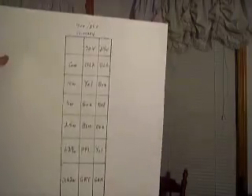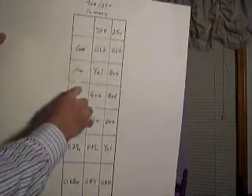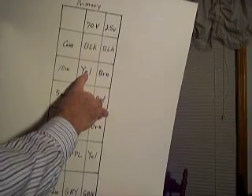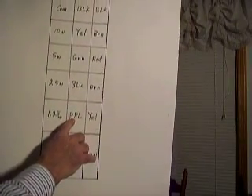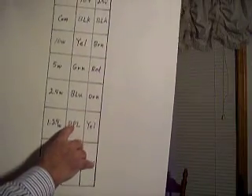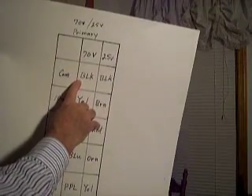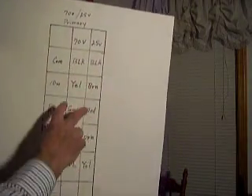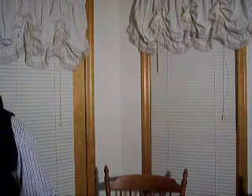Let's say you walk into a room and it's just a little too loud and you want to quiet that room down. Then you could go up to the speaker, pull the wire off the yellow coming from the amplifier, and move it down to purple, for instance. That would make that speaker a lot quieter. So again, you're really just dealing with two wires and one of them always hooks to black. In most cases, just hook to black and yellow — that's all you have to worry about. You can take the rest of the wires, coil them up, maybe cut them off with wire cutters so they won't short, put some electrical tape on them, and forget about the others.